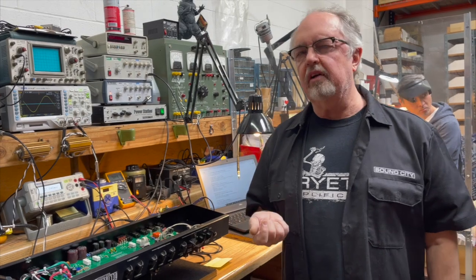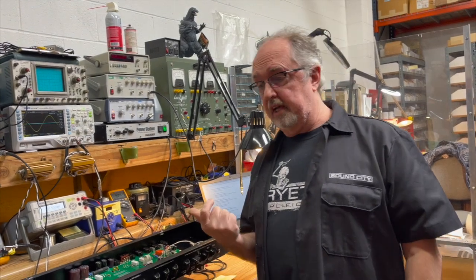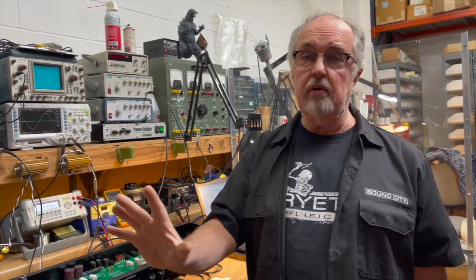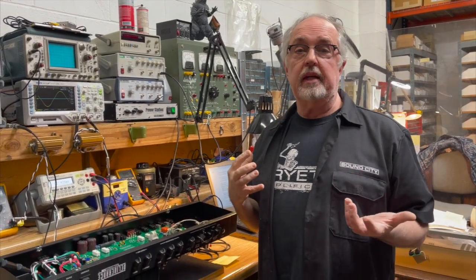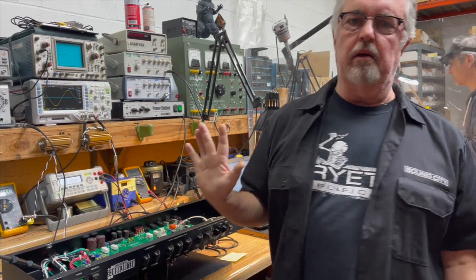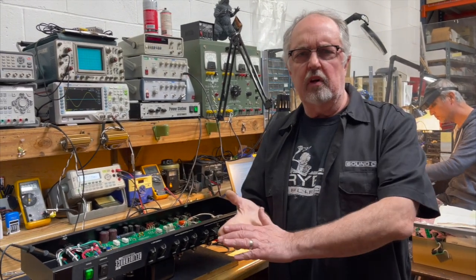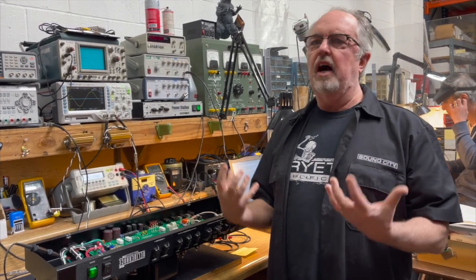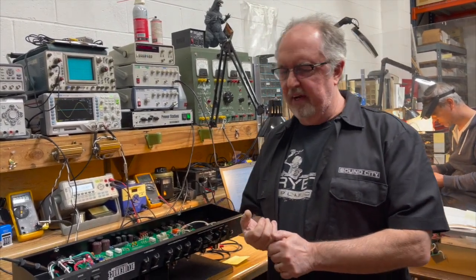You can experience a similar kind of phase inverter distortion by using a post-phase inverter master volume. What that does is turn the signal down after the phase inverter going to the power tubes so that you can jam more signal into the phase inverter. And as anybody who's done that knows, it sounds kind of pillowy and squishy. Some people like that sponginess. You're getting everything else up to the phase inverter going like crazy, but the power tubes and the output transformer aren't really working very hard. So they're actually adding a little bit of a clean characteristic on top of all this saturation. They still preserve the cleanliness, and it can punch and do everything that you'd want it to do.